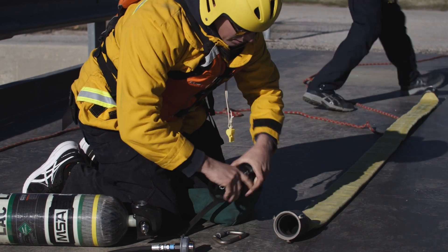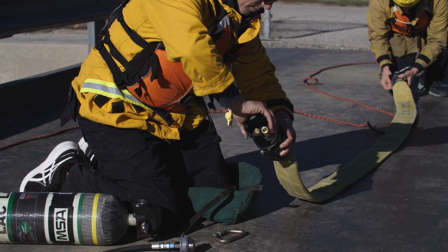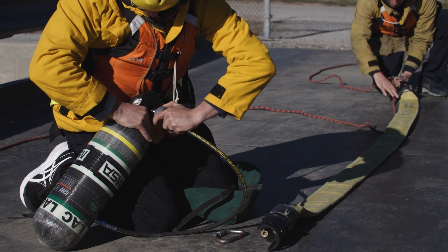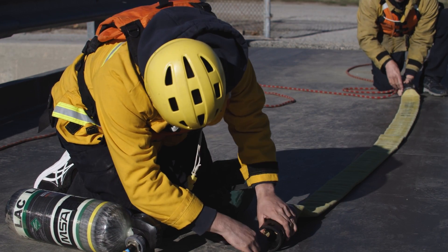The crew caps the hose with the hose inflator caps on both ends. Next, they will attach the high pressure hose to the cap and inflate with an SCBA bottle to operating pressure — enough to be able to still squeeze the hose.